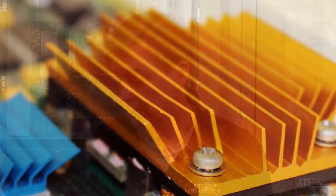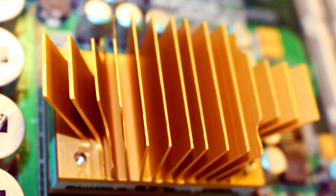In this case here, we're looking at a half brick DC to DC. Is that what these are, half bricks? Half brick size. Now, why would you use a half brick DC to DC converter versus another kind of power supply? In the DC to DC world, there's a lot of standard footprints, which allows for flexibility amongst different vendor selections. There's some standards — quarter brick, eighth brick, half brick, full brick sizes — which may be scaled based on power, feature set, or technology advancements. They tend to fall into standard footprints, which allows for interoperability and ease of PCB layout and also selection.